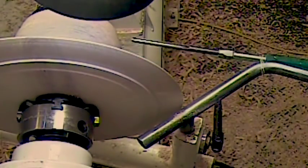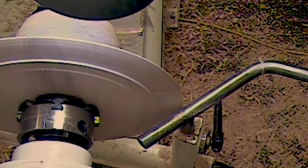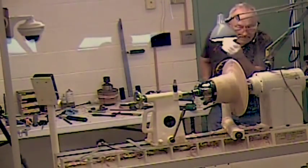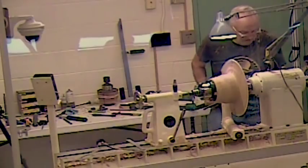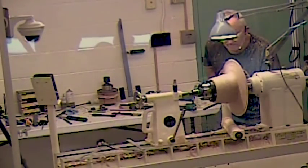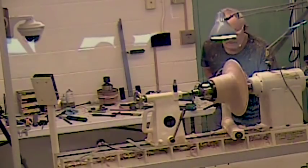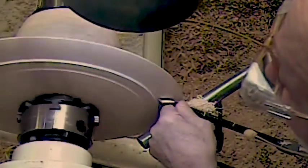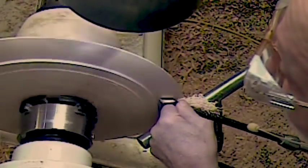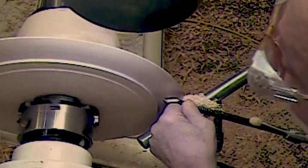I'm going to sharpen myself up a piece of half inch that has a V flute and a longer cutting edge. So now, with a sharp, sharp tool, and with the light here showing the ripples I see, I can get rid of all those ripples and really get a nice surface. Producing that darker color that we like because it's really cutting. It's not leaving any uncut fuzzy fibers on the surface.